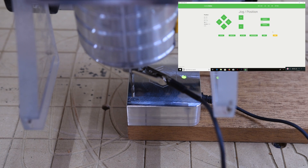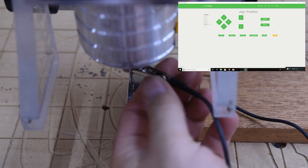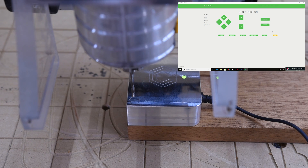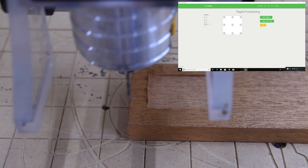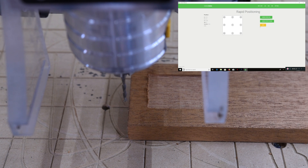It's that simple, folks — it probes a Z height and it's zeroed out on top of this piece of wood. You want to see if it's accurate? Here's what we'll do: we'll go ahead and run the last toolpath that I ran, and it should keep the same zero on the X and Y. That's my last X-Y zero, and it's got its new Z height now. Let's see if it works. Load new file — let's go up here to the desktop and find it. It is 'Touch Pro Pockets' — we will run this.